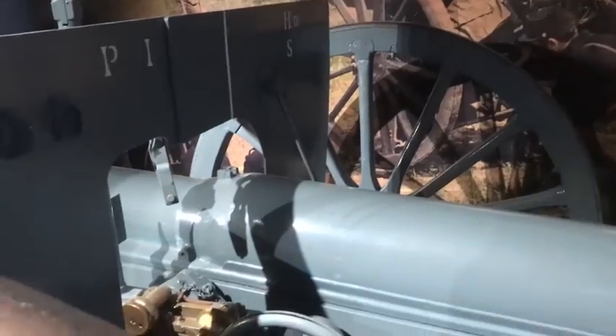What the Model 1897 introduced was a hydropneumatic recoil system. Just like a self-loading firearm, the whole barrel assembly slid backwards on a mount controlled by compressed air, oil, and springs, so that the gun itself didn't move — the wheels stayed in place. They also introduced wheel chocks and the concept of a spade trail, where you dig the back end of the gun into the ground to ensure it doesn't move backwards. That movement had previously been necessary to absorb the recoil, but now the recoil is absorbed by the barrel mechanism moving backwards, just like the bolt on a self-loading firearm.